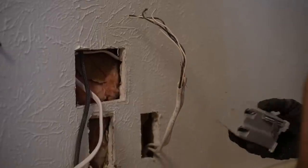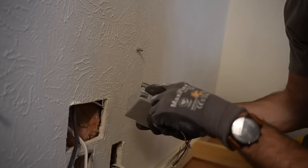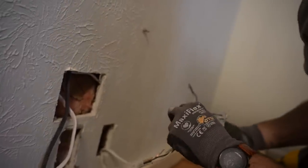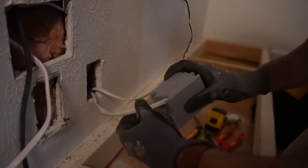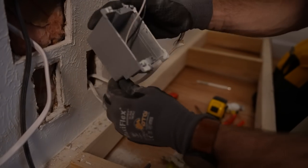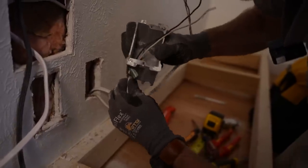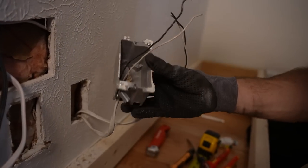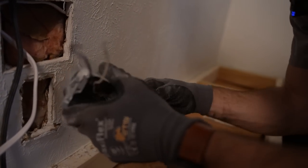I'll check my box size too. A lot of the wire stripping and prep is kind of already done for us here, but we're going to go in through the clamps on the bottom. If you need to, take a flat head to punch through your new box. We're reusing ours. It is code required that the jacket of your wire enter your box — you can't just have the internal wires. The whole jacketed cable needs to be in there, but only about a quarter inch or so. Basically get it in there with a big shove and then stop — that's about your quarter inch.